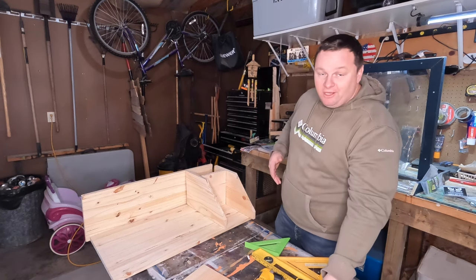About now I was loving the look of this duty rack and it really pained me, but I knew I had to take it apart to keep it quality. I was going to need to glue together the pieces as well as screw them in, and it needed to be painted. So once disassembled, I used a leaf blower and blew it off, got some tack cloth to clean it up, and applied a light layer of primer on both sides of every piece of wood.